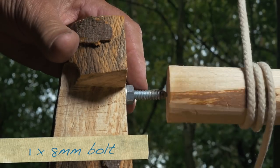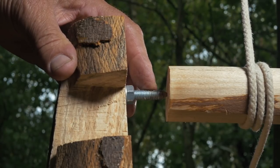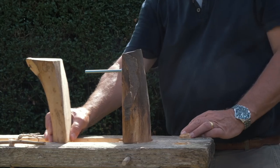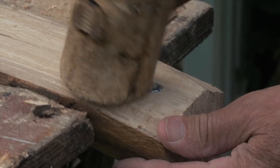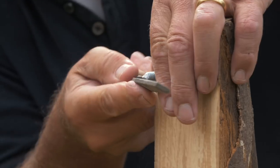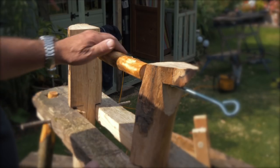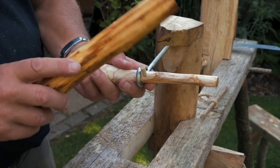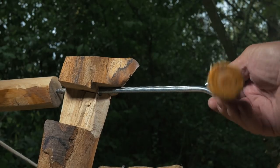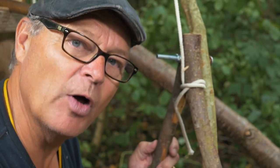The workpiece on this version is held in place by threaded rods which are spiked at the end, but I'm sure on the medieval versions these were simply iron pointed pieces of bar. By using threaded bar on this version I'm able to make small adjustments to avoid moving the poppet. This is the treadle assembly, made out of alder and ash.